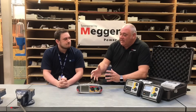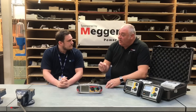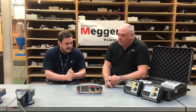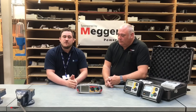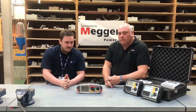We're going to have a look at setting up the RCD side of the MFT, and also look at a little nugget in the back of the settings. We're going to see the different application types for the different types of RCDs — moving forward, we're going to stop using the AC type RCDs, maybe moving on to A type, or maybe B type for an electrical vehicle installation, for instance.